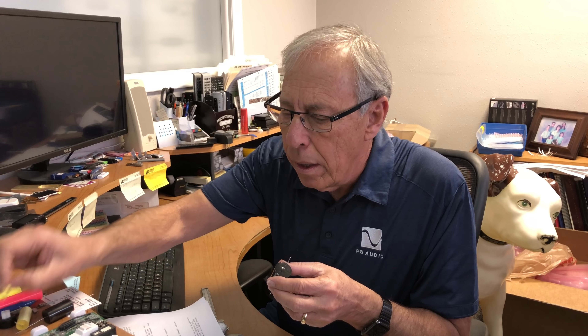We might use this capacitor in series with a tweeter. The way this works is a capacitor is a device that passes AC — which is a musical signal — and that AC is frequency dependent. This will pass AC but it won't pass DC; we use it to block DC battery voltage. When used in an AC application, this device will only pass, depending on some factors, certain frequencies. So a 10 microfarad capacitor hooked up to an 8-ohm tweeter is going to pass pretty much everything from a certain frequency up, forming a high-pass filter — the highs pass and the lows do not.